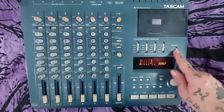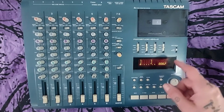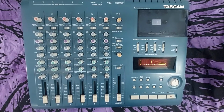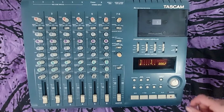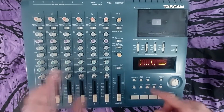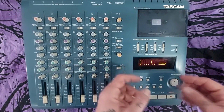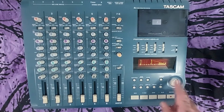In addition to the tape speed control, we also have this pitch control wheel down here. The idea is that this has been calibrated out of the factory or by your service technician so that if your favourite recording artist recorded a song in the key of C, then it plays back in the key of C. They've added this feature so that you've got the facility to incorporate instruments that aren't at concert pitch into your recordings. So say you've already laid down some bass and some guitar for your song at concert pitch, but then you get to grandma's piano, and it's half a semitone flat. You would be able to turn this so that temporarily the sound of your recording is in tune with the piano, and then once you finish the recording you put it back to normal and your piano will remain in tune with the other stuff. I think that's the main reason that they've included that.